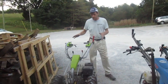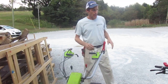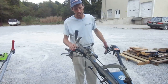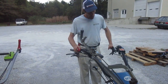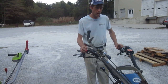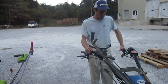The Grillo G110 has the active clutch system, meaning when you push this clutch down, it engages power to the machine. On the BCS 749, which is a hydraulic clutch machine with the power-safe clutching system, you have a clutch handle on the bottom. When you let out the clutch, it's going to engage power to whatever you're trying to engage. The safety handle on top on a power-safe unit is also hooked up to the clutch, so when you let it up, it disengages clutch drive as well.